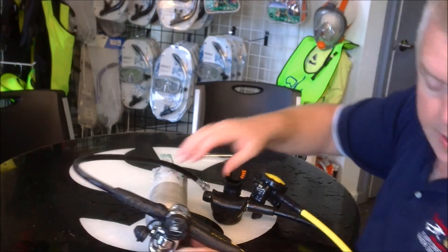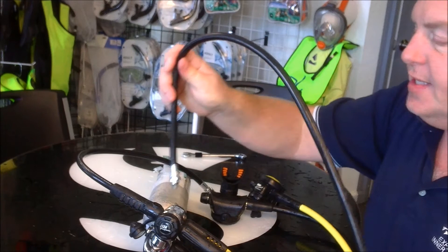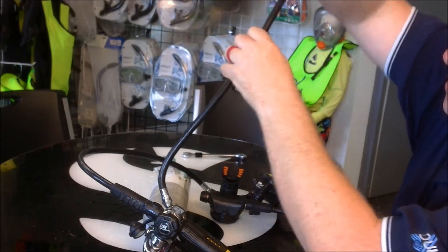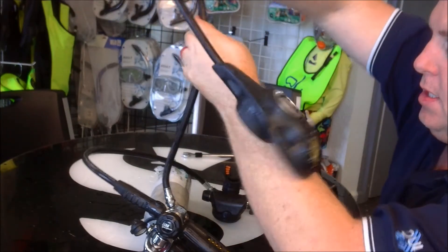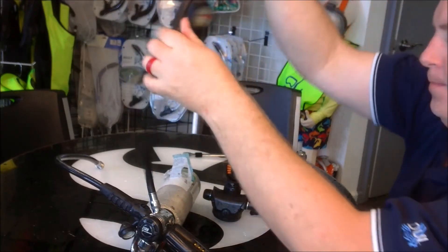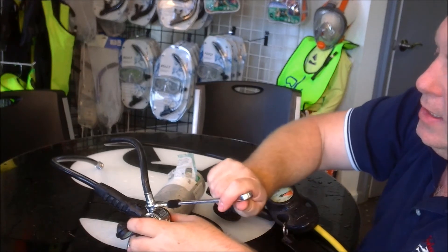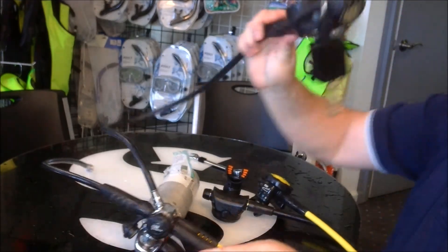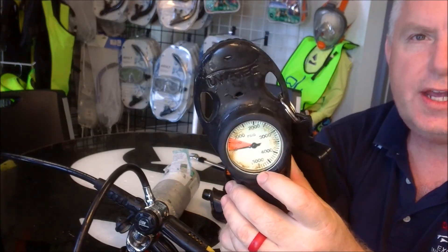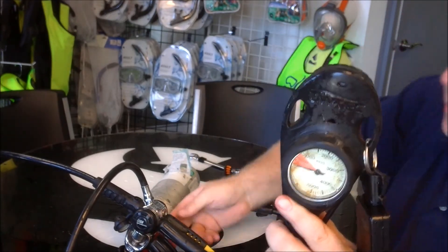Now I'm all set to reconnect my pressure gauge. I specifically installed a pressure gauge that has had a lot of moisture run through it over the years — it's several years old. Tighten up my pressure gauge: remember, finger tight, fast finger tight, not man tight. Looking at this pressure gauge, you can see it's fogged up and has rust stains, which is a good indicator it's had a lot of moisture pushed into it before. It's about to be replaced.